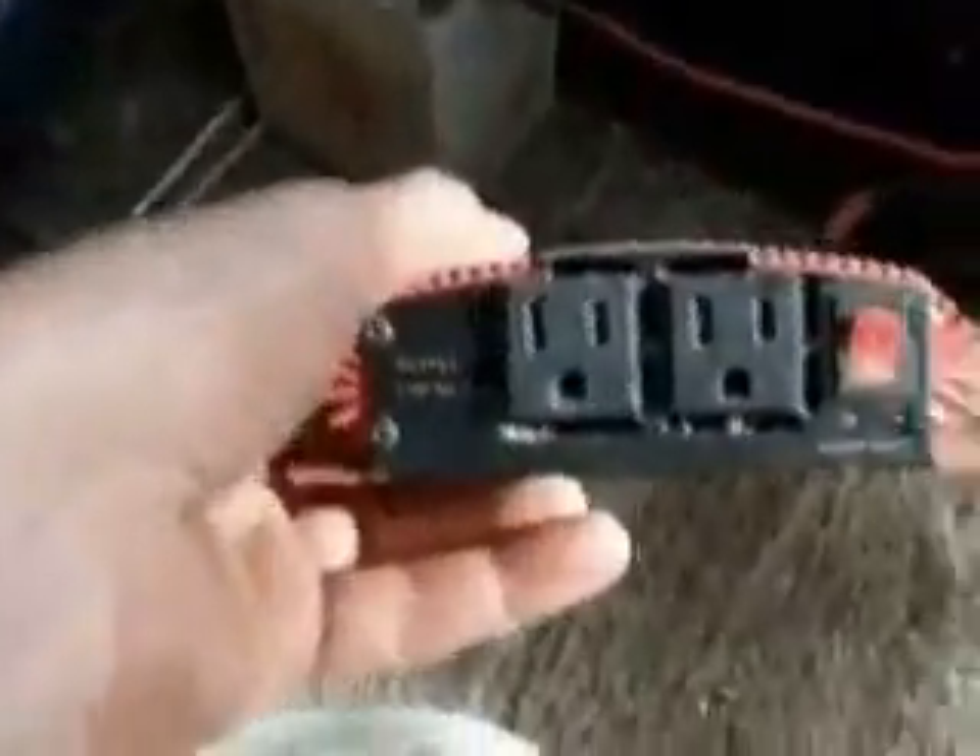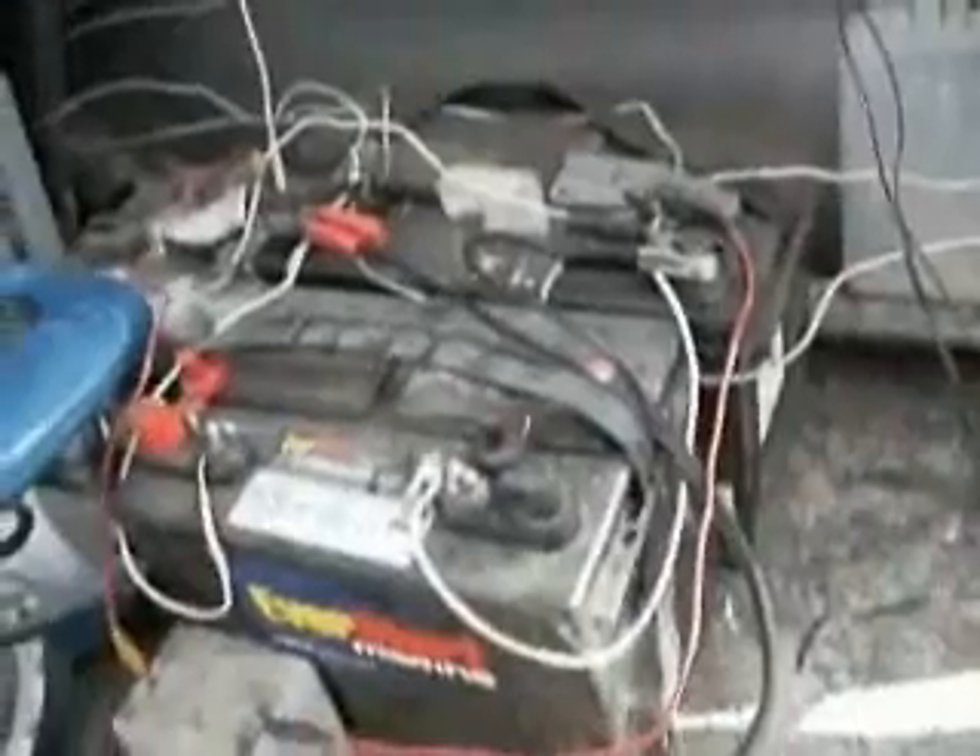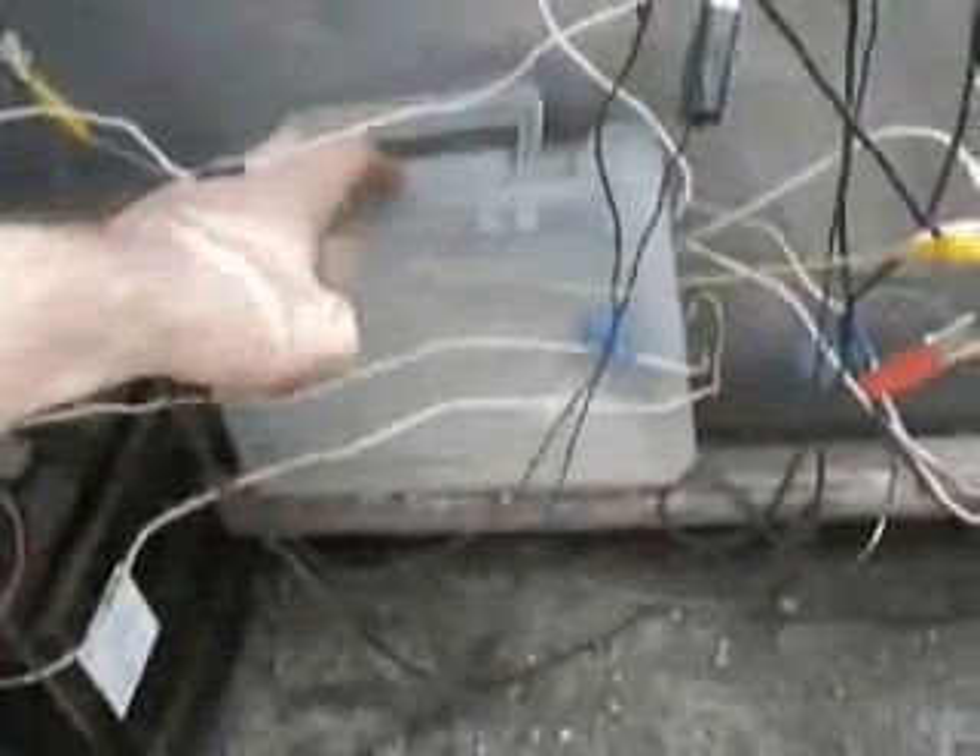To get some magical plugs that come out of nothing, I have a 400 watt inverter connected to some car batteries — they're actually deep cycle marine batteries — and those marine batteries are being charged by some solar panels. But there's a charge controller in here that shuts off the solar panels to the batteries when they're full, so it doesn't overcharge them.